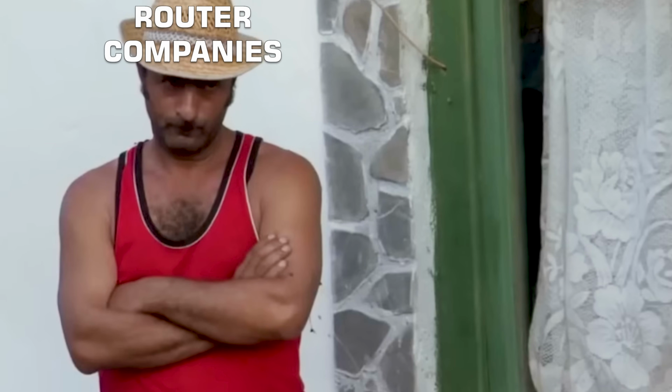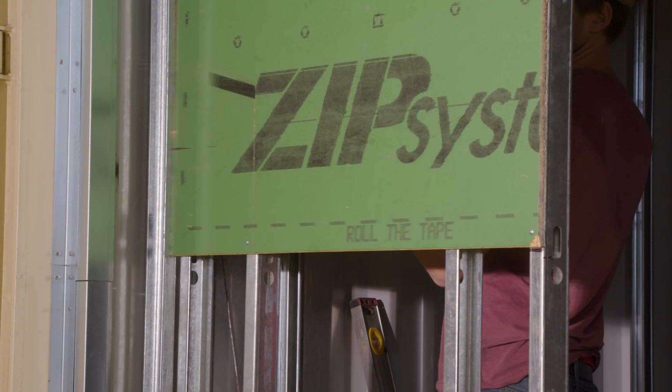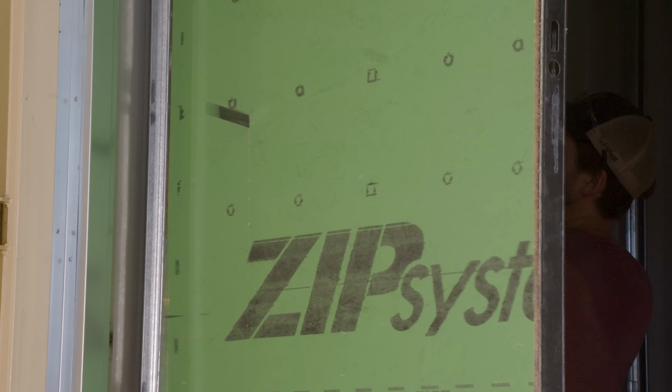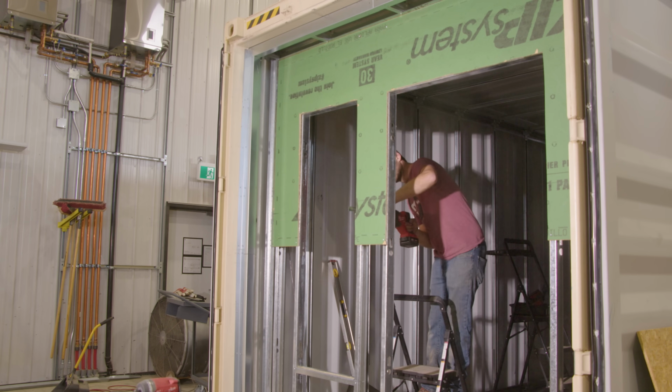Great success. If you're using steel studs for interior walls, you can actually table saw some softwood lumber and stuff that inside of the stud. And then if you need to use a wood screw through your hinges, or you want to air nail it or something, you can actually hit some wood and not just go right into a steel stud. I don't think they did that here, but that's definitely something you can keep in mind if you want a bit of extra rigidity right around your door frame.